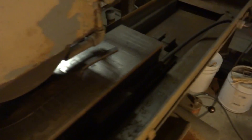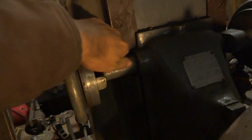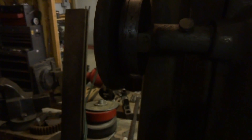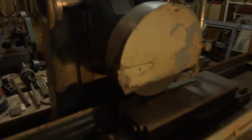I've got it on the chuck there near the wheel. I'm going to turn the mag switch on — it's on there good and tight. I happen to know that this is near the thickness of the knife blade, but I am going to loosen this set screw and crank the grinding head up a little bit, away from it, just for safety's sake. Then we're going to locate the surface.